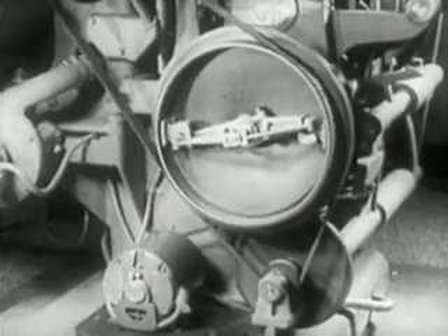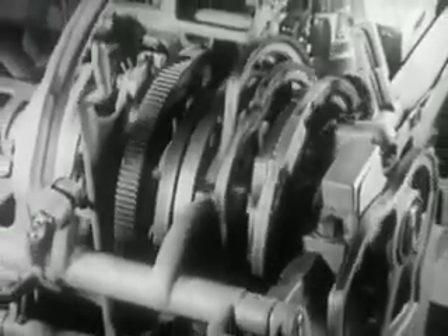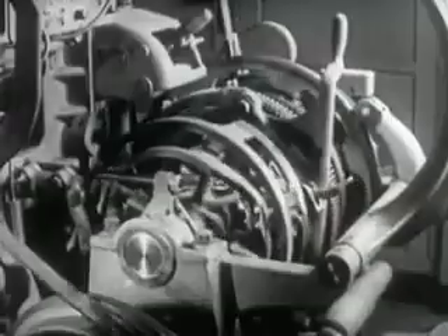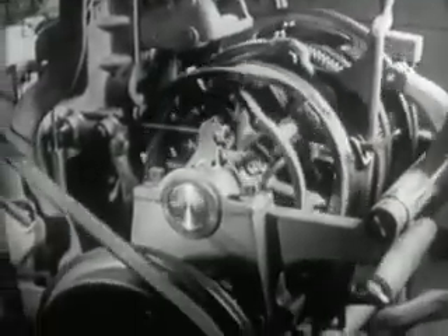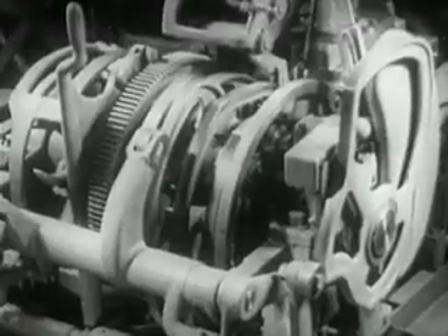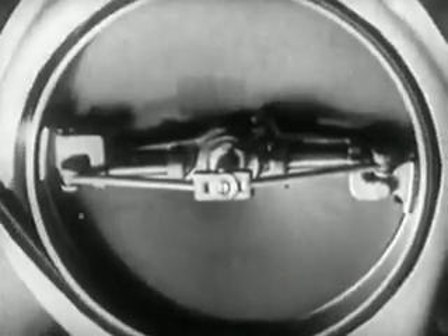Let's go into the explanation of this group. A one-half horsepower motor supplies the drive transmitted by a large pulley through a transmission gear and belt. Many of the basic mechanical actions of the machine depend on the 10 large eccentric cams situated at the rear. With a series of springs, they make up a completely automatic setup. These eccentric cams are synchronized to rotate together since they are all mounted on the same shaft. The cams begin to rotate as soon as the delivery slide carries the matrix line into the first elevator. This releases a spot in the delivery cam at the rear of the machine. The two friction shoes of the driving clutch are then pressed against the inside of the driving pulley, thus causing the driving shaft to rotate the cams.